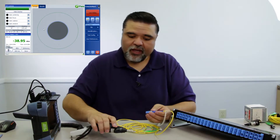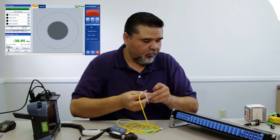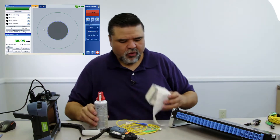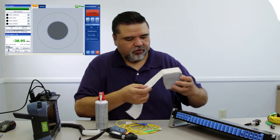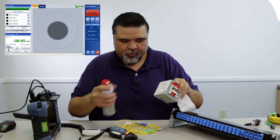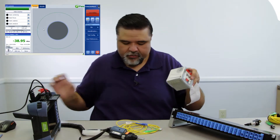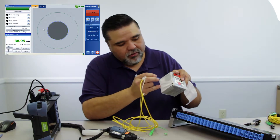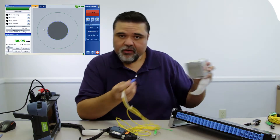If I wanted to do the wet cleaning method — this connector is already clean, but I'll show you how I do it. I pull out some more dry tissue, hold it on the bottom of the box for tension, put just a little bit of cleaning solution on the corner, then start in the wet and pull into the dry: one, two, three. Simple as that.